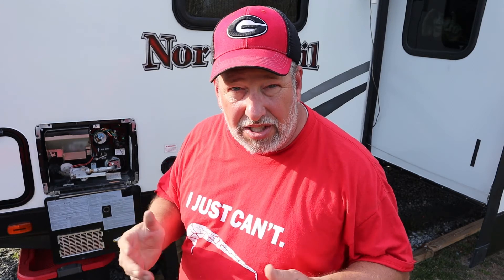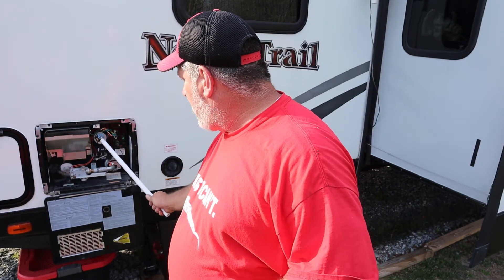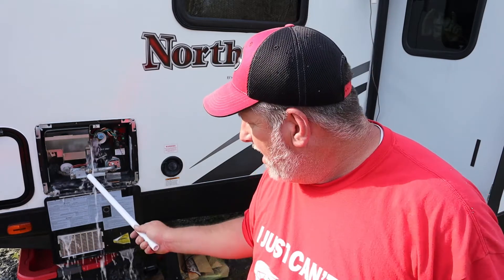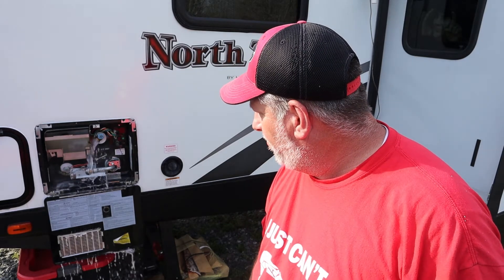It's been six hours — time to get the vinegar out of the water heater. Make sure you cut your power off, both electric and gas, and re-ensure your water supply is off. Then it's just repeating the process. If you've still got hot water in here use extra caution — rubber gloves. I've got a little PVC pipe I use just to open the drain valve. Release that pressure, then remove your plug. It's still a little hot, so remove your plug and let it drain out. Once it's drained, we'll flush it again.